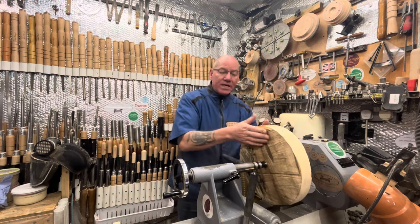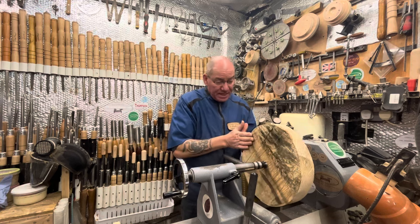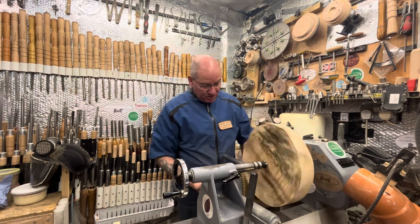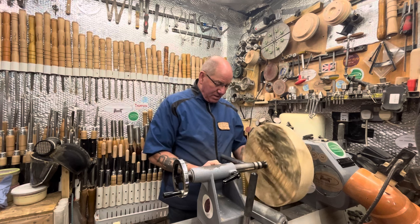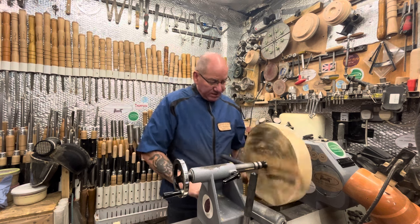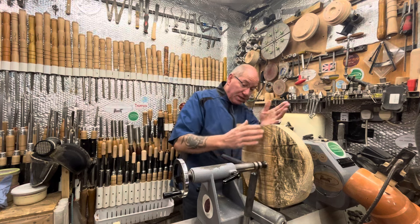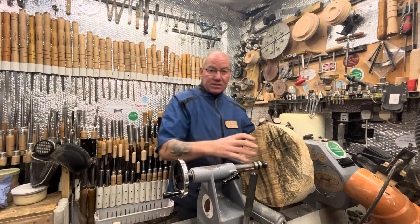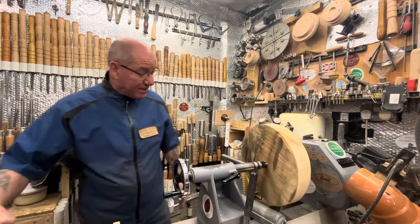It's going to be a shallow tray, just a tray type, not a bowl. I want to bring it down to that, so I've got to get rid of quite a bit of this bulk on this side. Okay, so I can't turn it too fast. Just going to bring that in there, get that so that bit. I'm going to take that down, and then what I'm probably going to do is put a recess in the bottom so I can turn it around, get it on a chuck, get this end sorted, so this will be the bottom, and then I'll be hollowing this side out afterwards, and I'll get my foot and everything put on that. So I'm just going to play it by ear and see how it goes.